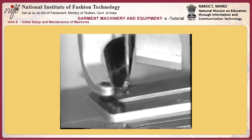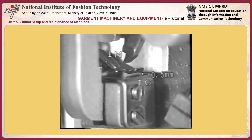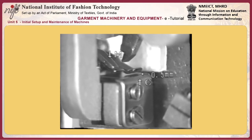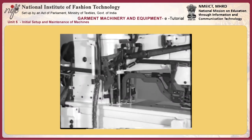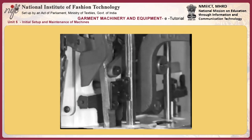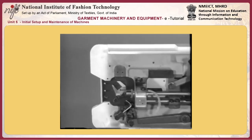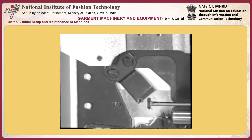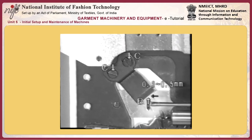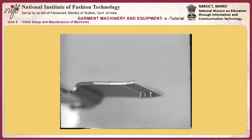If locking bracket latch C is installed when tilted, it can come in contact with top end G of the latch presser arm. Be sure to tighten the screw in the locking bracket latch with the latch held pressed downward. Then, move knife driving bracket B back and forth to adjust so that the needle thread trimmer gradually opens after the top end of the needle thread trimmer shaft comes off the locking bracket latch. After the completion of the adjustment of the needle thread trimmer, be sure to turn the feed handle to check that the needle thread trimmer comes in contact neither with the work clamp foot nor the needle when it opens.